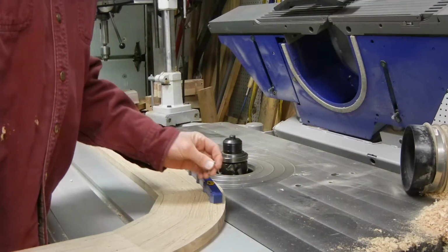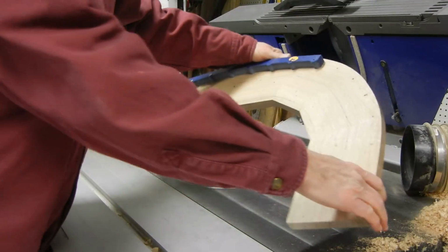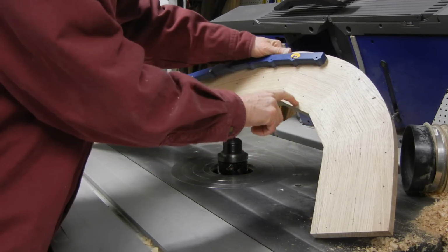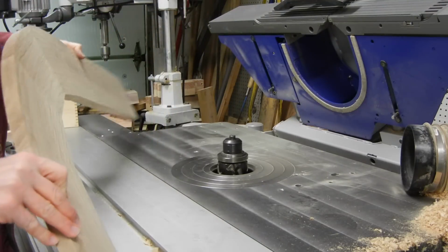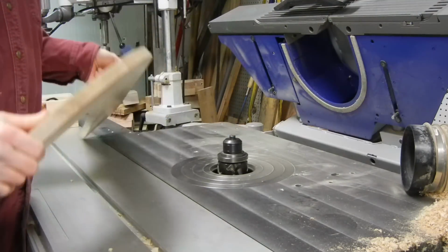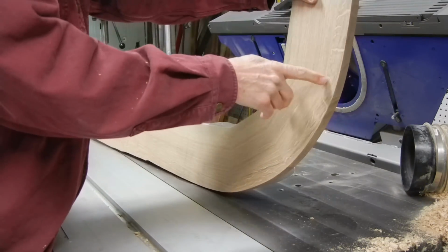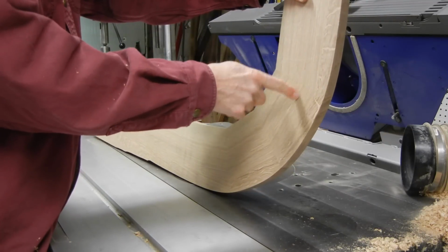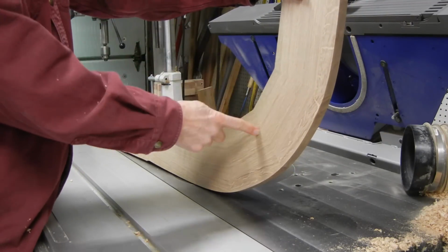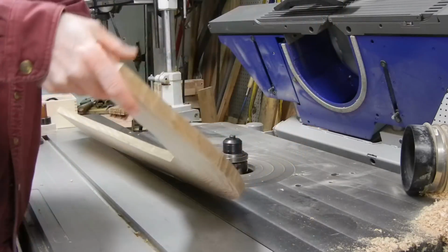What I do is I go in and draw a line on the, this is my cutting line here, done in ink. This is on the back side of this piece of molding that I'm preparing. This is a white oak. I've got some angular cuts, like 14 and a quarter degrees on both sides for 28 and a half for these three, and then I have a 5 degree angle for that.